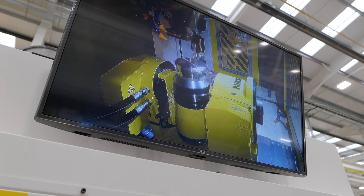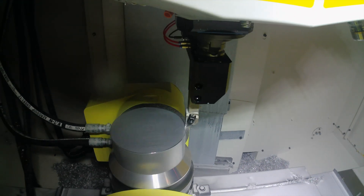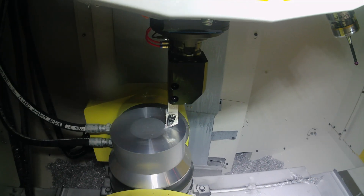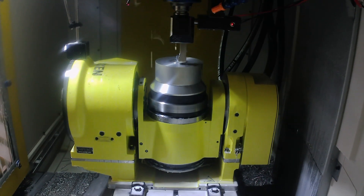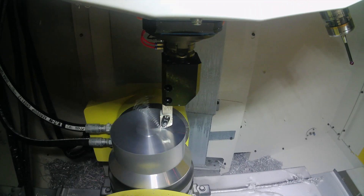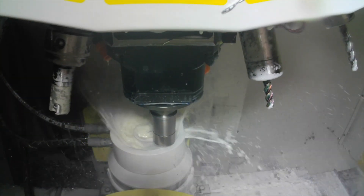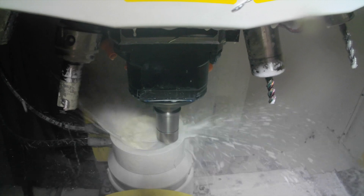It's almost like you have a lathe built into this with the really great five-axis capability of a standard RoboDrill. The five-axis capability of the RoboDrill is legendary, especially coupled with the direct drive table. The axis is tuned for that five-axis application to give really smooth motion. Couple that with AICC2, which is the thousand-block look-ahead capability of the B5 series control — unparalleled smoothness of control and just an all-round great five-axis solution.